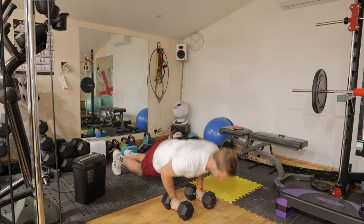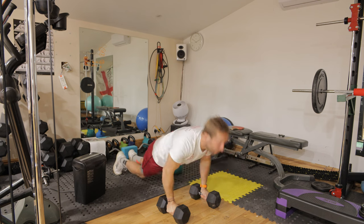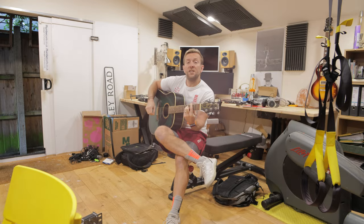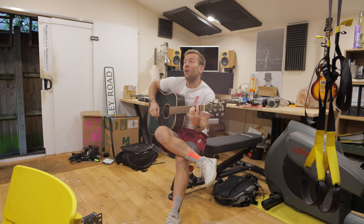So you're going to join me as I guide him through this job. The first thing Dane's going to have to do is successfully turn his hot and cold water off. After that, he's going to have to remove the old shower hose. Then move on to the hardest bit — removing the old shower valve, preparing the new shower valve, and then installing the new shower valve before turning the water back on.